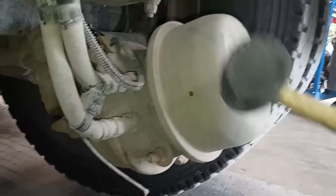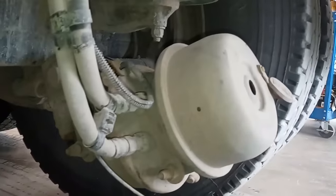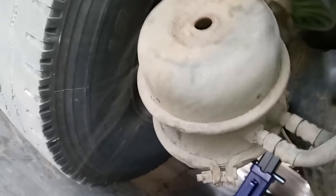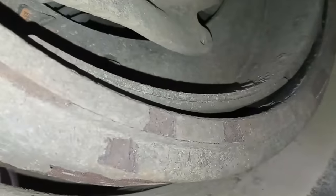One of the reasons it's not working — listen to this. This is the parking brake spring chamber, and this is actually super common. The spring, which is super strong and thick, will actually break. If I'm doing a DOT inspection, I'll tap these with a rubber mallet — it doesn't hurt them. But if there's a jingle sound, you know the spring is broken and the can needs to be replaced. That can did need replacing. But this other one isn't working because there's like a three-eighths of an inch gap between the drum and the brake shoe — no gap on top. It had cammed over, and the lower roller was flipped out on the bottom. Thanks for watching.